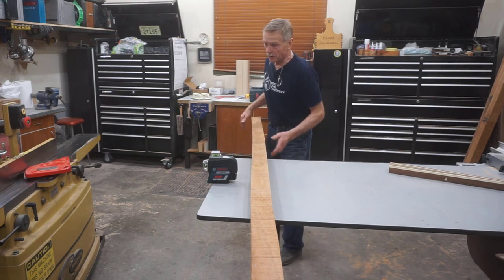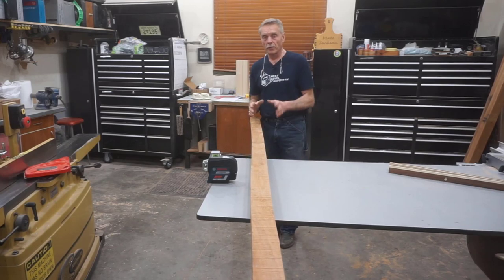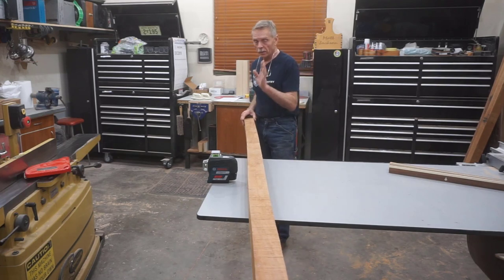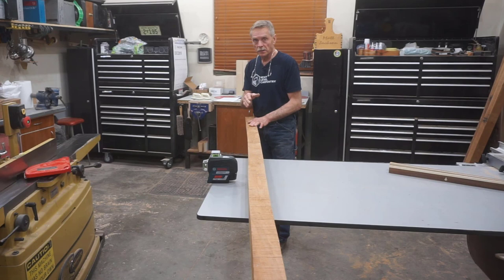With years of experience, all it takes is a quick eyeball on the end of a piece of lumber to evaluate what needs to be done and the quickest way to get it done. But by way of explanation, what I'm doing when I eyeball the end of the piece is looking for a perfectly straight line that will eliminate all the dips and bumps in the piece. Twist is separate. First off, I want to decide which face of the board to start off with.